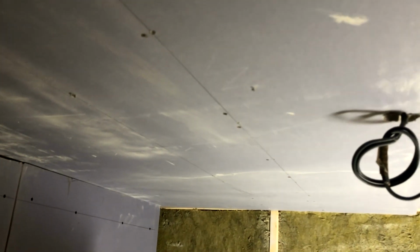That is a terrifying experience, putting that up and then gradually lowering the drywall lift and hoping the ceiling doesn't fall on your head. Unfortunately, you have to do the ceilings first, because then when you do the walls, they are helping to support the ceiling.